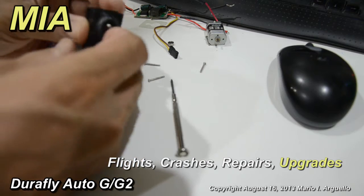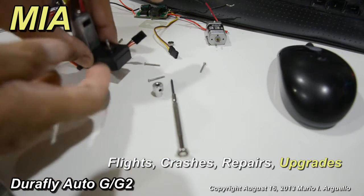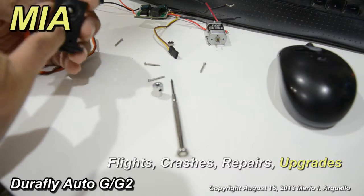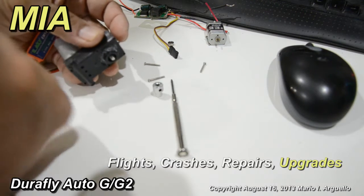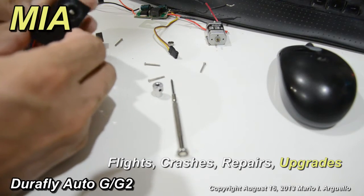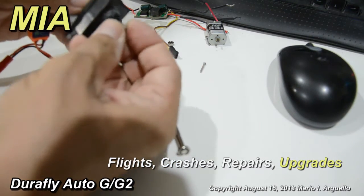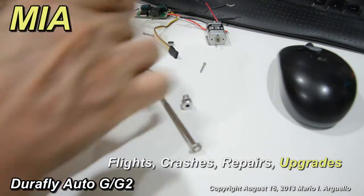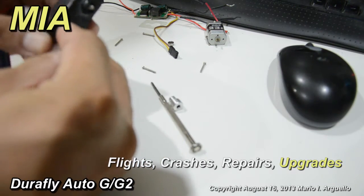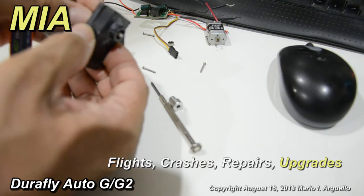My case is a little messed up because originally, not realizing this was a screw-on part, I tried to pry it out with a press. I was encountering tension and actually cracked this part slightly because I put too much pressure. Since it wasn't giving, I looked deeper and came to the realization that this is a screw-on part. That's one of the things you run into without knowing how the gearbox was assembled — but now you're aware of that.